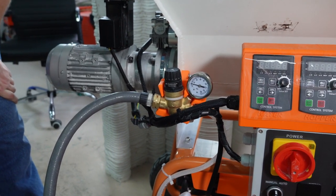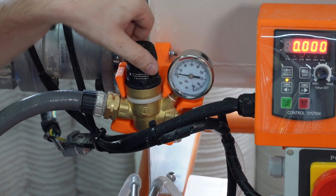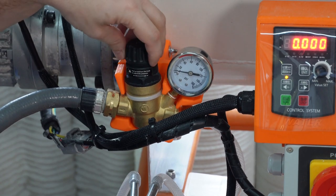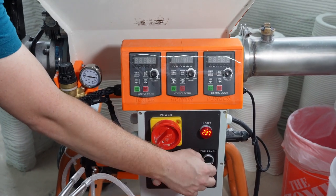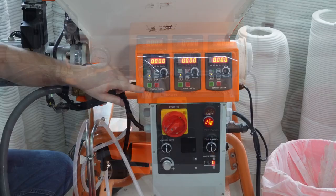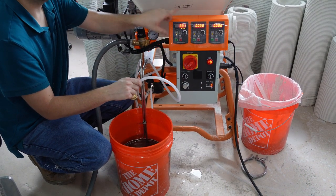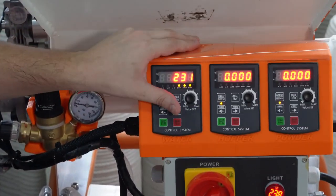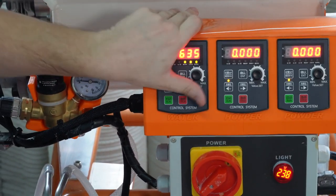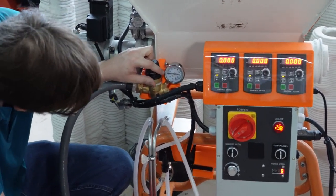To start, connect a water hose to the input. Before setting the water pressure, the water system needs to be primed. We will first be setting the water pressure between 10 and 20 psi while priming the system. Turn the main power switch and the top panel on, then turn on the water pump. It may take up to two minutes for the line to prime. You can increase the water pump speed to speed up this process. To set the water pressure, turn on the water pump for about two seconds and then shut it off. Wait for the pressure on the gauge to equalize before adjusting it.